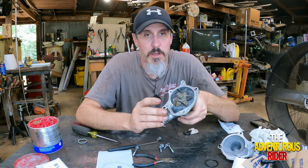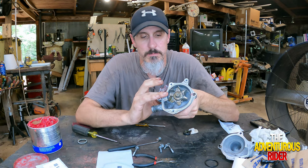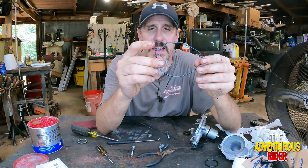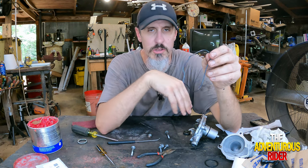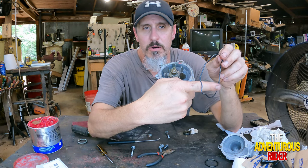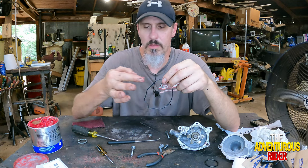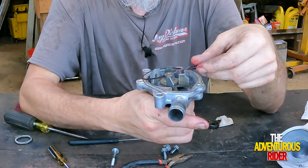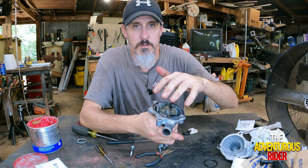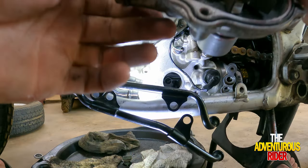The other O-ring goes right here between your front housing and your back housing — here's the part number. As you can see it's kind of molded in a certain way so it fits in the groove right here. After you put some grease on it, make sure you're putting it in the groove the way that it's molded. Once we have the grease on and lay it in the groove, the grease will also help it stay in place when you put the front cover on while you get a screw in to hold everything together.